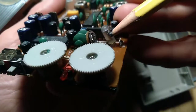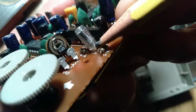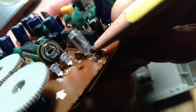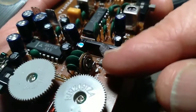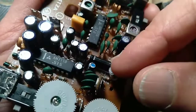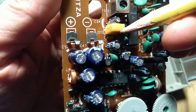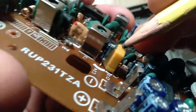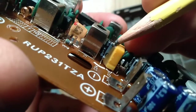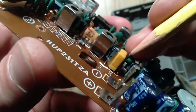Right adjacent to this multiplex decoder is a very curious capacitor — this is a polystyrene film capacitor. These capacitors are very temperature stable and have very low distortion; I would imagine heat may play an issue in this part of the circuit. This one labeled CF — I believe that stands for crystal filter — and look at how it's wax-potted to this adjoining C24 capacitor.